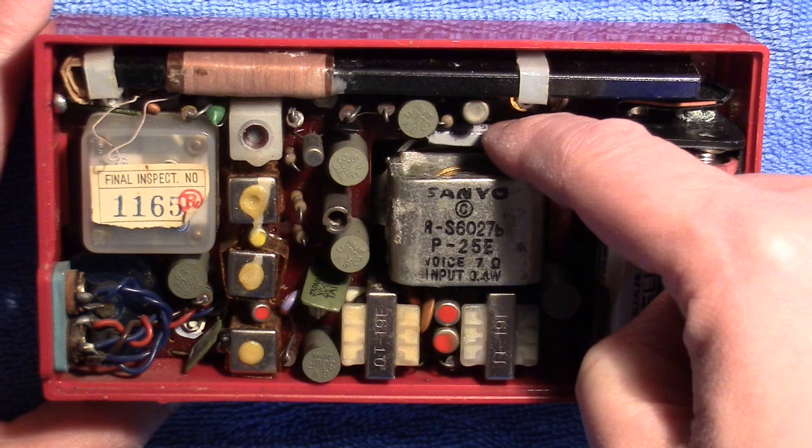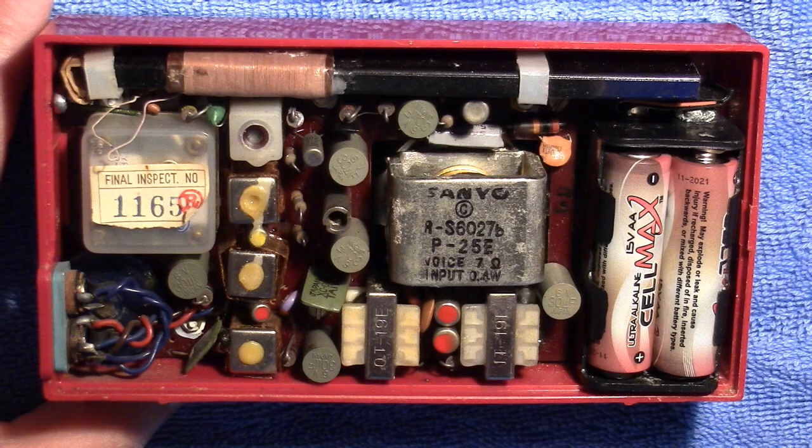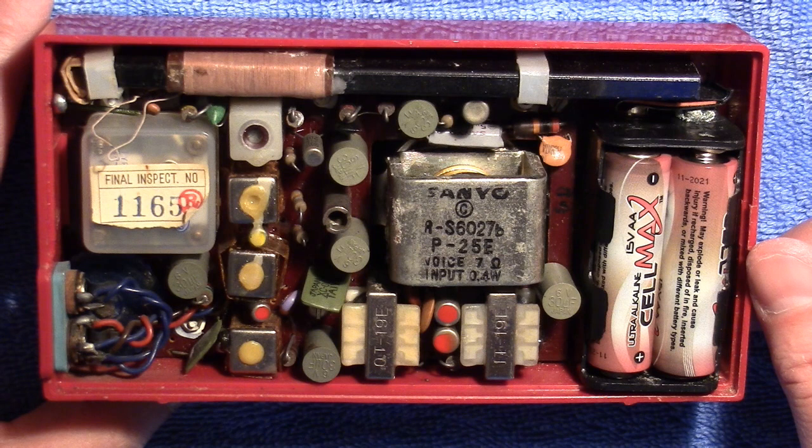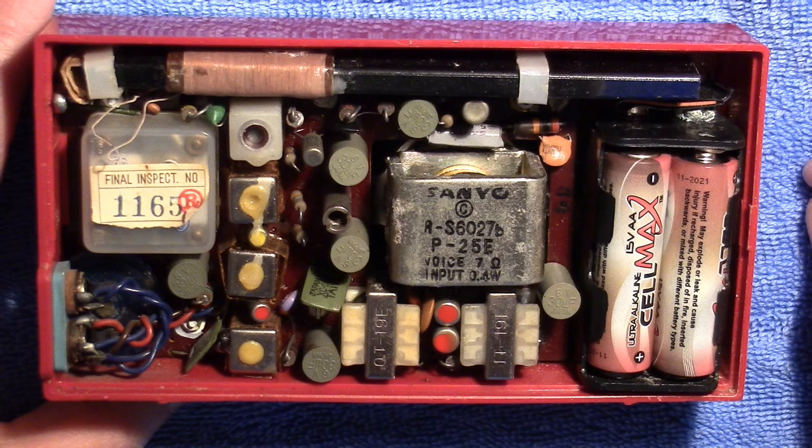So I got those for the six here that need replacing. And there's one that I think is a five microfarad capacitor, which doesn't exist, so I got a 4.7 microfarad for that one. I also bought some other values — some 22s and 47 microfarad as well, just to have on hand. And I got extras, so if I have any more that need 33 microfarads I'll have them. I think I spent just about as much in postage as I did for all those capacitors.